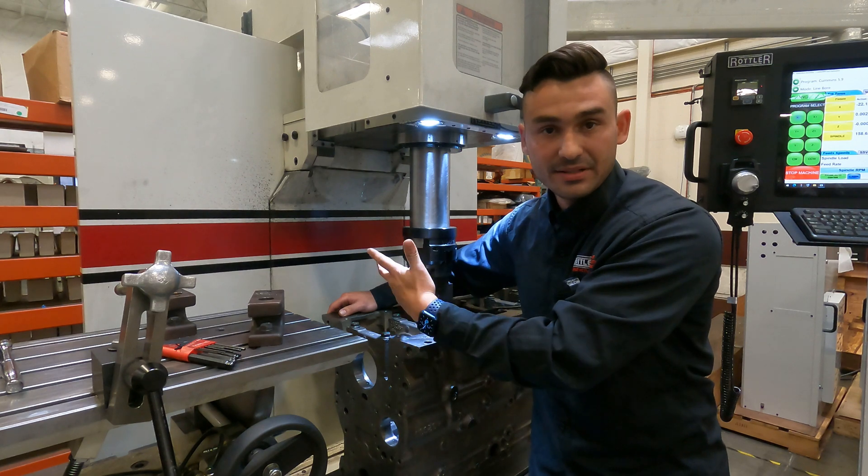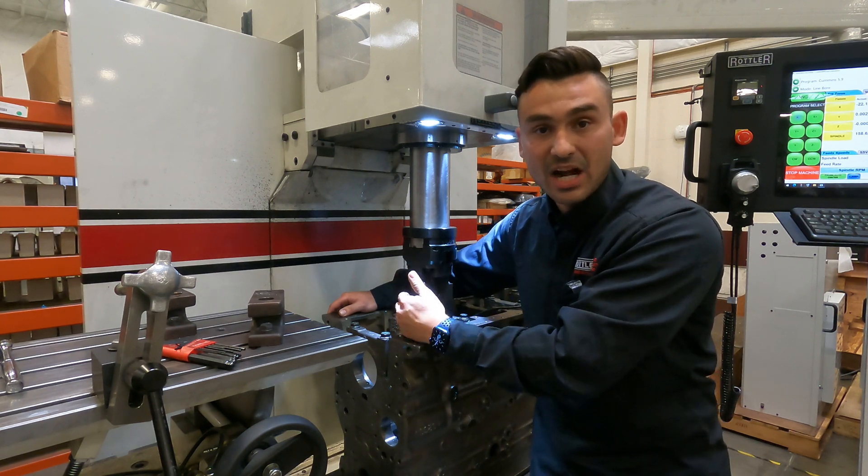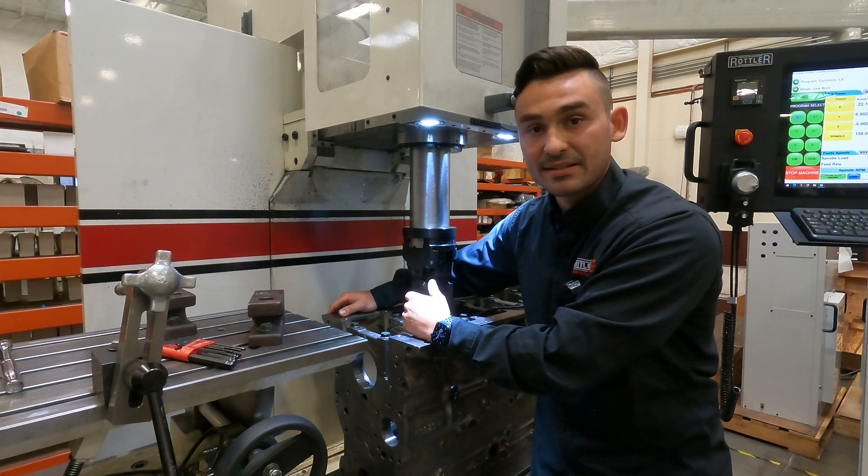It's not uncommon to want to clean up a little bit in the block — maybe go one thousandth of an inch into the block and then nine into the cap. For this demonstration, this is just a standard block and we haven't taken anything off it, so we're just sweeping zero and zero. But that process is the same — you just need to know how much you've taken off that cap.